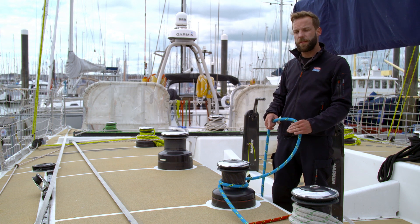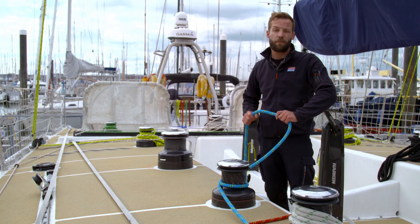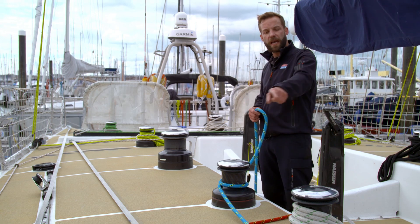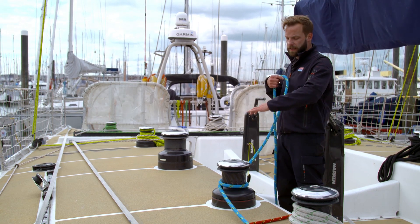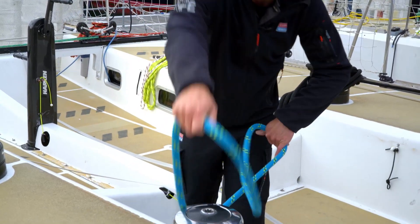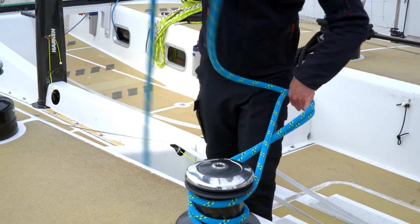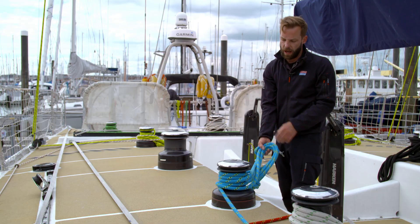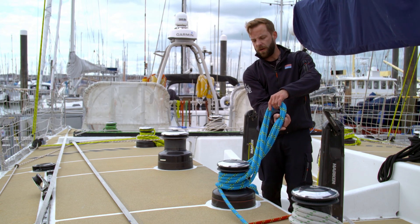When we want to tidy up the rope at the end, you're going to finish it off with a figure of eight. The reason we use a figure of eight rather than a straight loop is that to create a straight loop you have to put twists into the line. If you put a twist into the line, it means when you go to ease it out, that little twist can get caught in various blocks. So the figure of eight is the way we want to finish it off. The best way to do this is to orientate one of your hands downward and catch the line like this. You then go alternate ways — around the winch clockwise, and then around your hand anticlockwise, clockwise, anticlockwise. You end up with the line in a figure of eight, no twists in it, but the two parts are not interlocked.